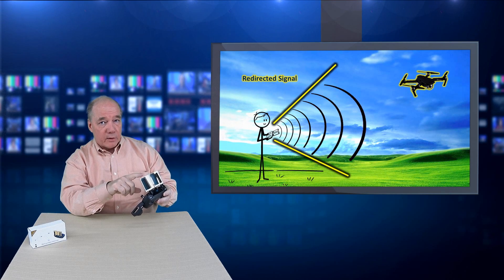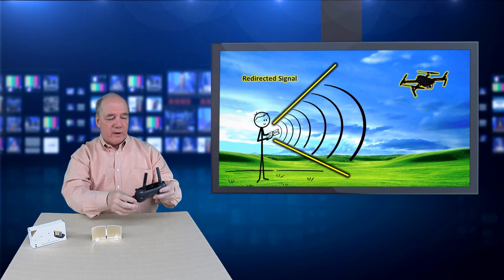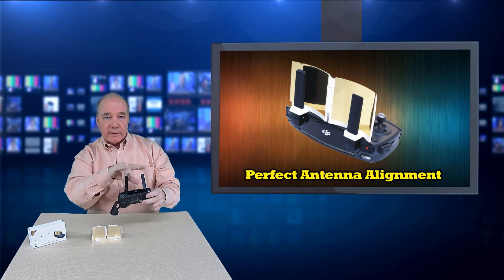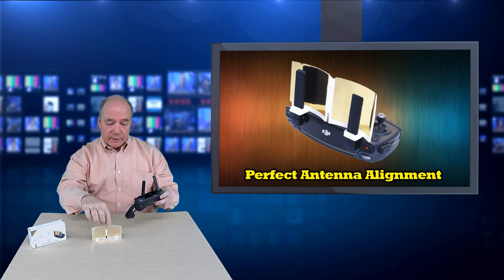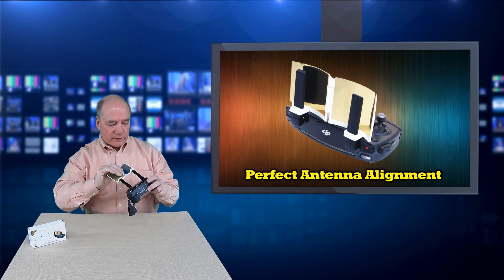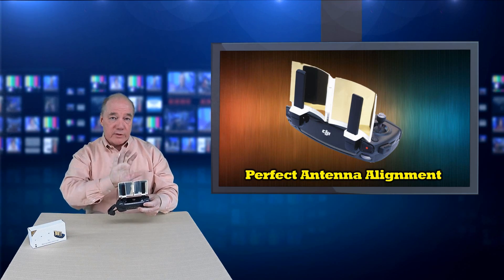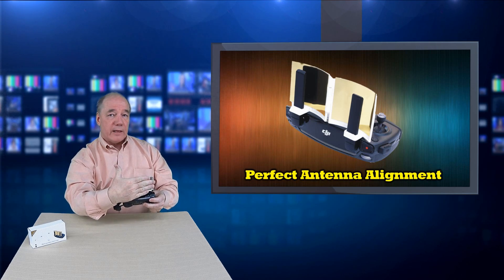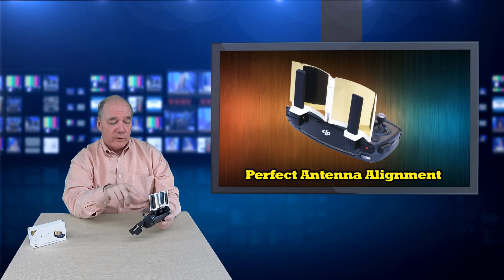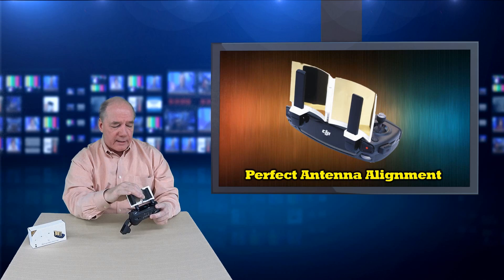Something a lot of people don't realize is that the position of your antennas is super important. If they're set up a little wonky, not perfectly aligned, you're dramatically affecting your radiation pattern downfield. By sliding these on the antennas, they actually force the antennas into perfect alignment — a parallel set of antennas both forced to face the same direction. So in addition to reflecting the signal, aligning those two antennas gives you an additional boost in signal strength.